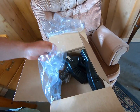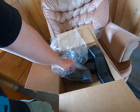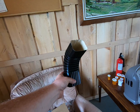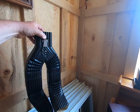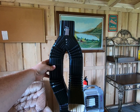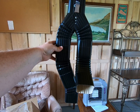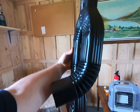And the other piece that we have is the part that would go towards your water barrel. I have one of those already completed over here, just put together and ready to go into my installation. So you can see it — the Y on the top diverts down for both parts. I have my left side set up here for the downspout onto the lawn, and the right side set up for the rain barrel. We're going to head outside, install this, and see how it works.